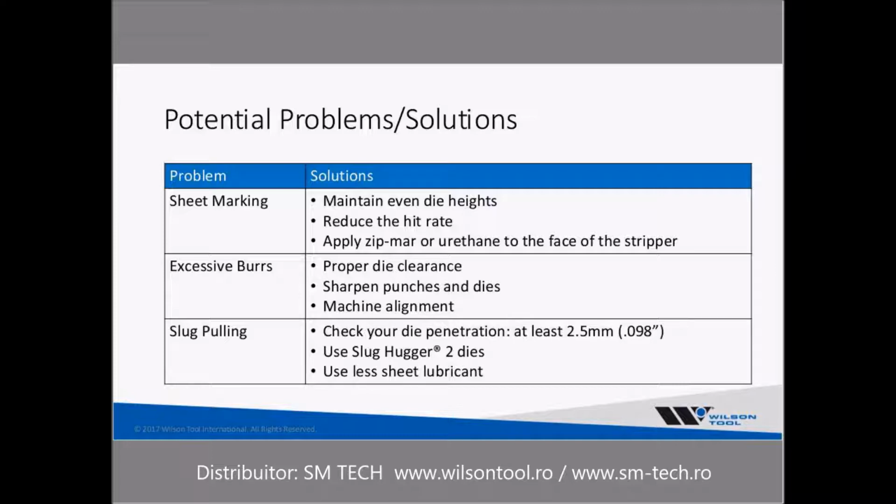For one thing, taking them out and sharpening them and putting them back together can be time consuming. So when you can do all of them at the same time, that certainly helps reduce your downtime. And one of the things that we recommend as well, and we'll probably say it again, is if you can coat your punches so that you don't have to remove them from the multi-tool as often to sharpen them and keep them clean, you're much better off. So something to consider with multi-tools.